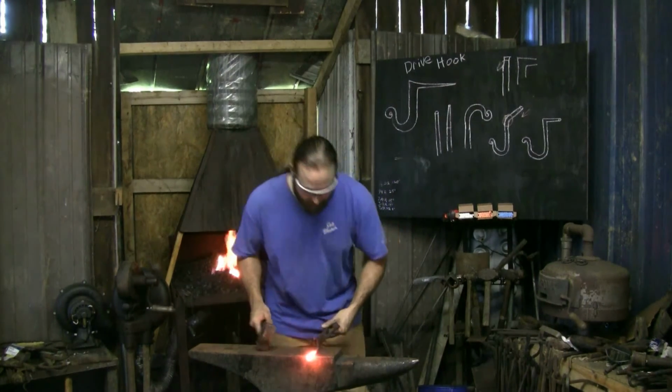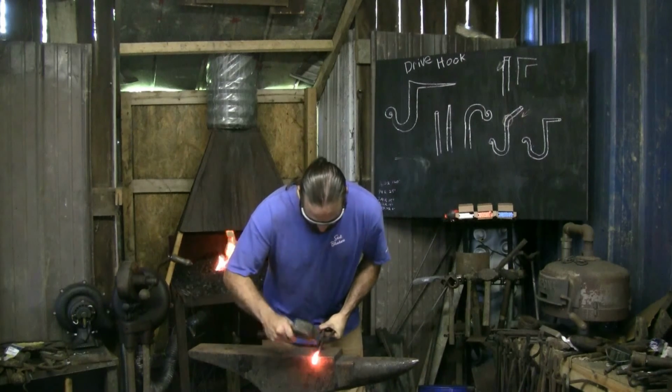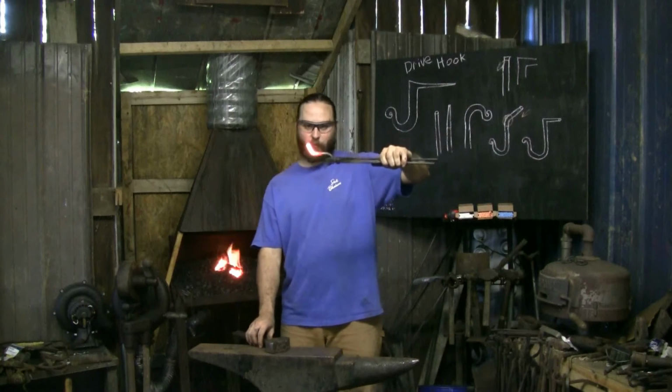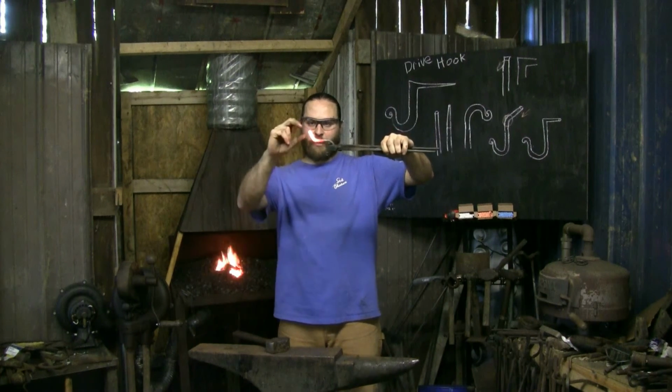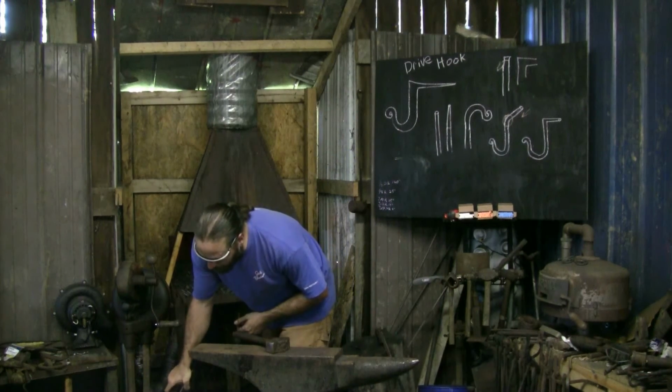All right, nice and hot. Just gonna bend it right over. I'm gonna bend over probably 1.5 inches here. Not quite 90, a little more than 45. But I want to heat this part right here in the bend. And I'm going to quench this top section off maybe 1 inch. I'm going to go ahead and quench some now, that'll prevent it from heating up as quick.